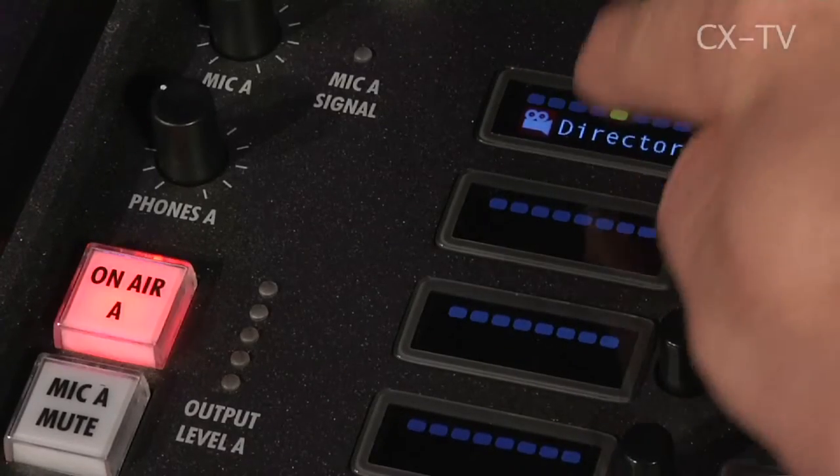Mm. So one obvious way that you might use this, for example, just imagine you're at a racetrack where the audio from the headset is coming out and going off to television land, but you also want a button where you can talk to the director, in which case you can program the button to mute the microphone and feed your audio through to the intercom. It mutes the on-air output of the mic and then feeds it to the intercom. Well, essentially, if you're there, bang, you've just muted yourself, taken yourself off air and talked to the director in one go, release the button.